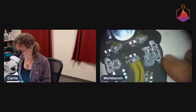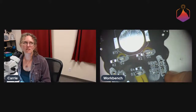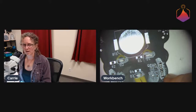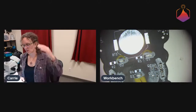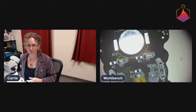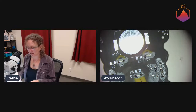It's funny. I feel like we should maybe put together a super basic SMD soldering kit. Although there's one from GikFun, GIKFUN, which you can get on Amazon. I don't know if it's available anywhere else. If you search for SMT soldering or beginning soldering, it's pretty cool. It's about the size of a business card, and it just has rows. They give you a whole bunch of excess components, so you can solder an entire row of 1206s and an entire row of 805s and an entire row of 603s to really get in the groove and get practice, figure out what techniques work for you the best.